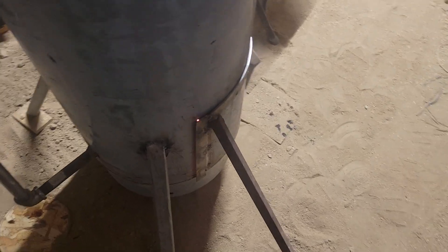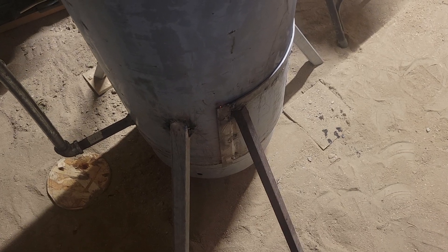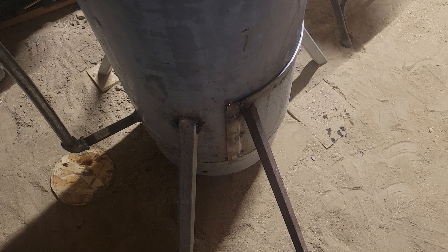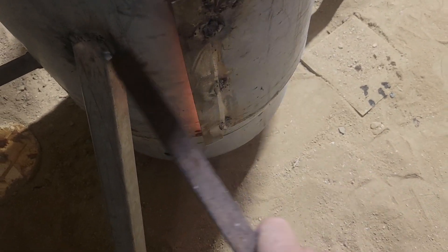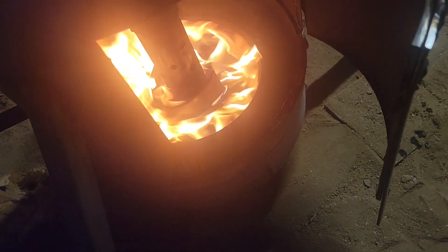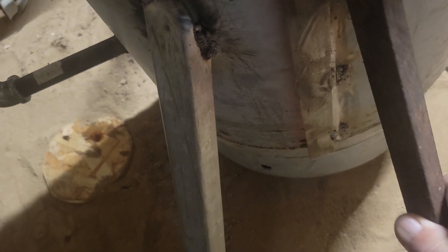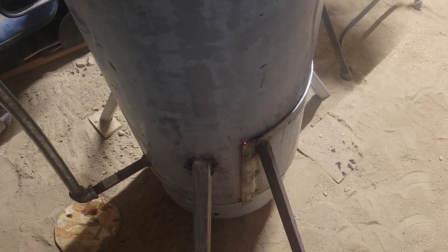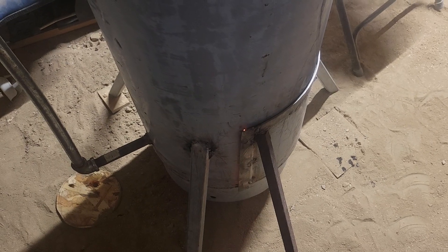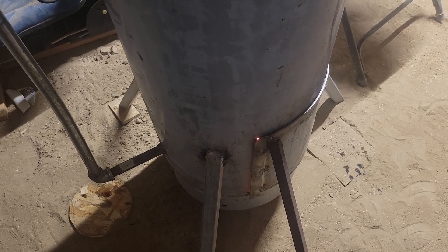So that's what I did. I brought it in and put it in there. One thing I found out was that when I did the burn test after I put the chimney on, it never burned off all of the oil because the burn plate never got hot enough to vaporize it. But look at this — yes siree! I got that little curved plate in there, which is heating up faster than the base brake drum, and it's hot enough to vaporize the oil. This has been burning now for probably 45 minutes.